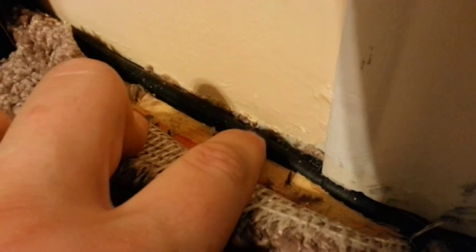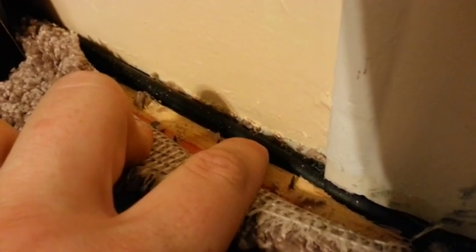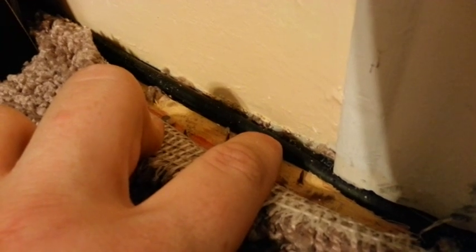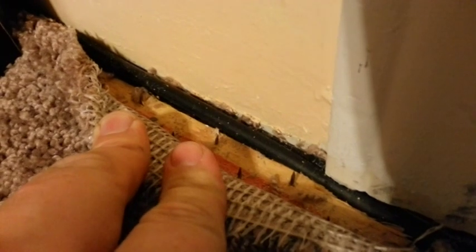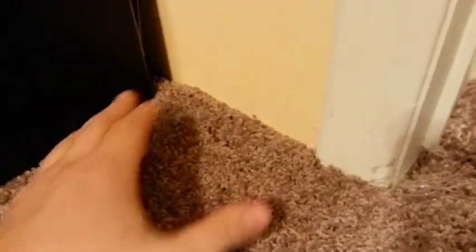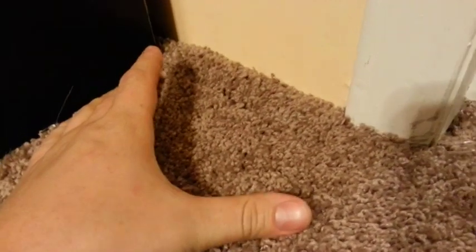You can either cut the groove in, or if you have only one wire crossing the wall you'll actually be able to fit it in there — especially something thin like a phone wire. But I have an HDMI wire and a regular cable TV wire, so they're really thick. In that little corner I don't need the carpet to have a grip from the nail board, so I just leave it like that. As you can see, you can't see the wires anymore.